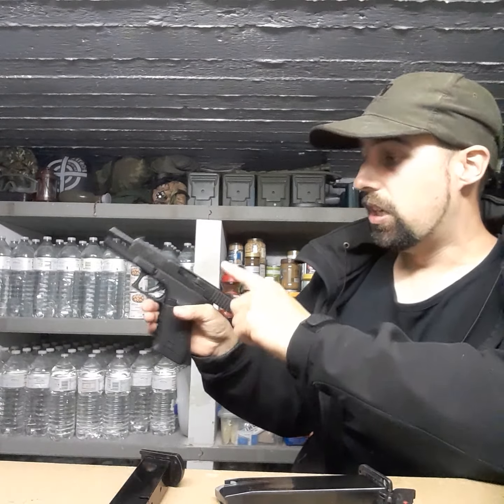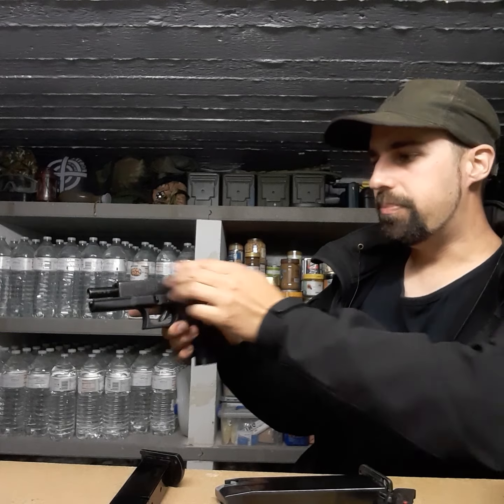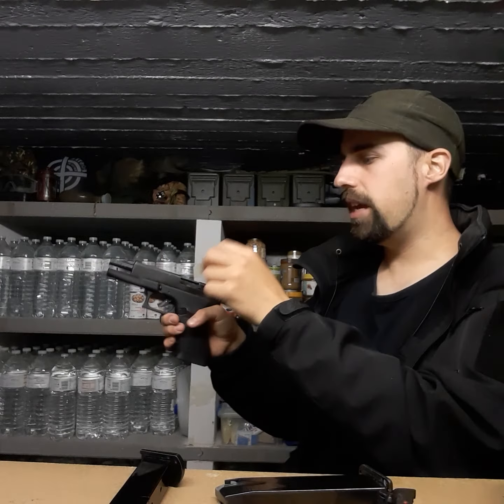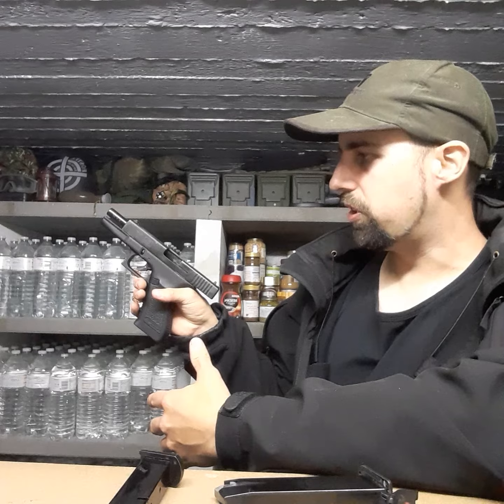This is actually a fail of showing a fail, because usually when I fire this Glock pistol there is a problem with a so-called stovepipe. That means the slide is too heavy, doesn't travel far enough back, and the ejected cartridge gets stuck between the feeding lips. So after every shot I normally have to: take the magazine out, rack the slide so the stuck case falls out, reinsert the magazine, and load again. This time it didn't happen, which is weird. But in general, this model is not really reliable in my opinion — though it's better than nothing.